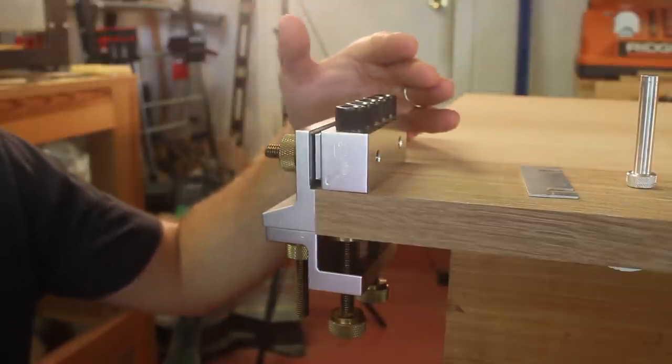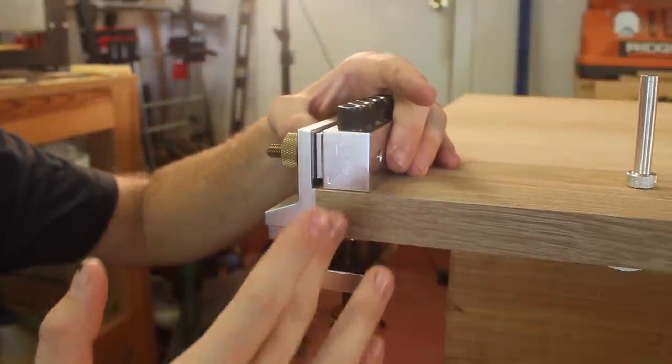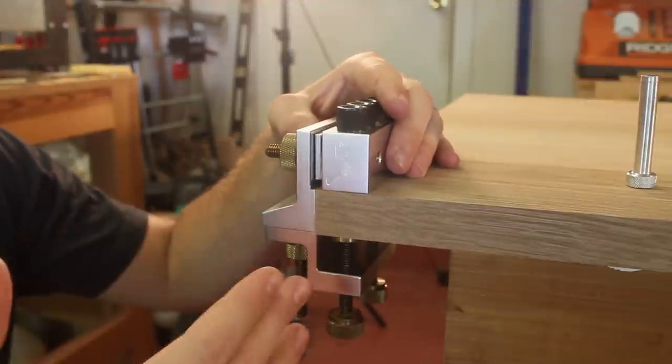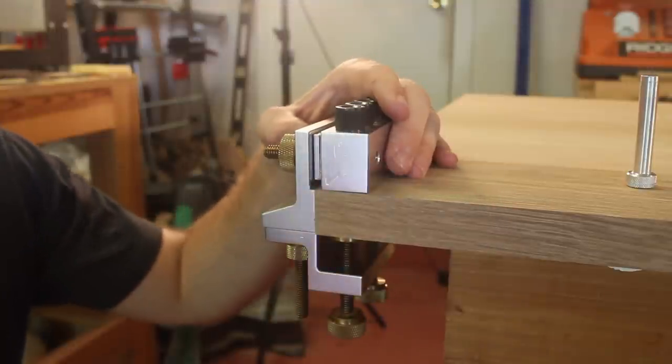And so I just like to purposely mitigate that by adding this 1/16 inch spacer, and that makes sure that everything in this dimension is lined up perfectly. And to compensate, as far as my plans are concerned, I added 1/8 inch to the length of this piece because it's a 1/16 for each side.